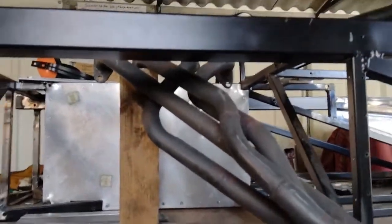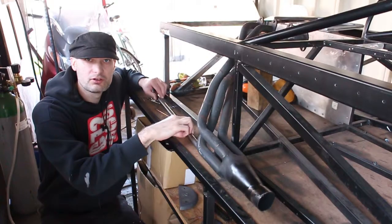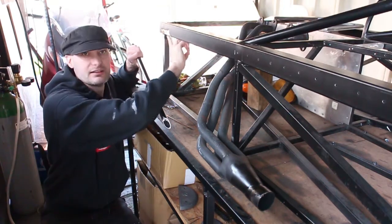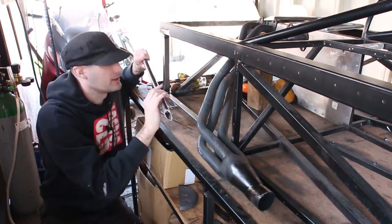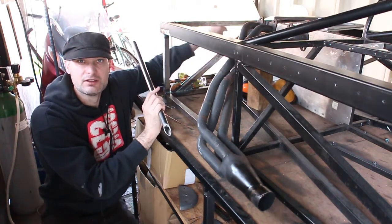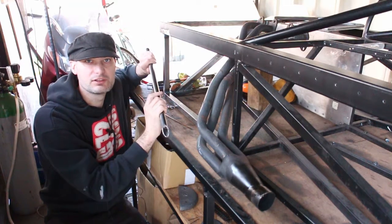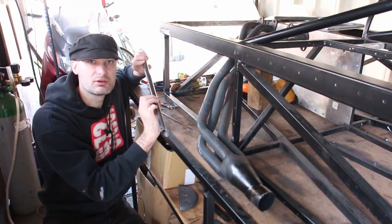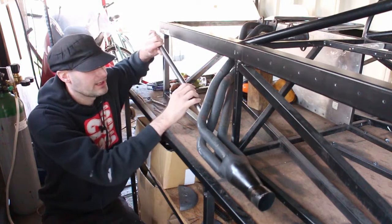What I'm going to do is use a round tube this time, because it will be easier to get into the corners and I won't have to do these diagonal sections like I did here, so it should make fabrication a bit easier. This smaller tube should also be a bit stiffer than the square.